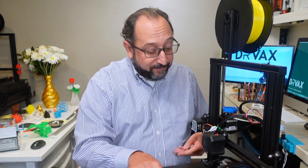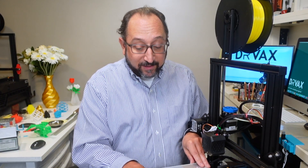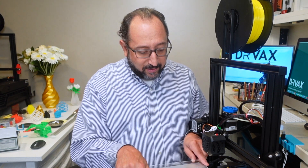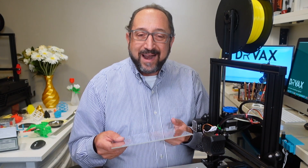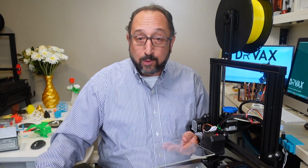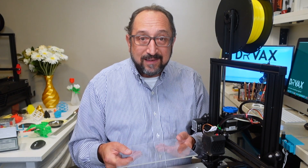Are there any other print surfaces that might work on any printer? Well, there are other alternatives. What about printing just on glass? This is a sheet of glass provided by Creality — it's actually a little bit too small for this printer. I've used sheets of glass on printers with unleveled print beds, but I don't like printing right on glass. It will work sometimes, and with Magic Goo it will work reliably, but I still don't like it. The adhesion is not excellent, and there are better alternatives.